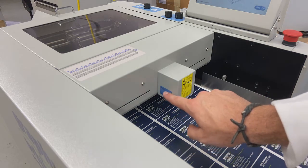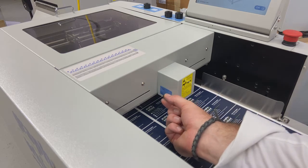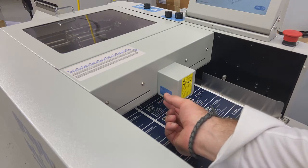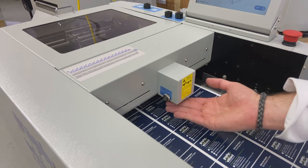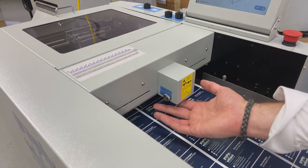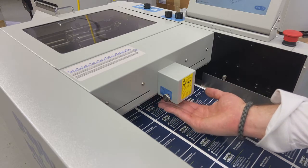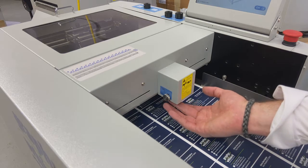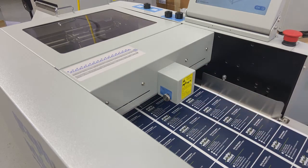On my feeder itself, I've got this one small knob that only turns 5 to 10 degrees. It's not an error, and that's how it's supposed to move. And what this one is doing is, if you put your hand underneath the machine, making sure it's not running, and lift up, there's a little plastic finger, and if you push it up, you can hear it click. So I'm doing it right now, and I can hear it click. My microphone's going to be canceling out the noise for you, but just reach under there and feel that.